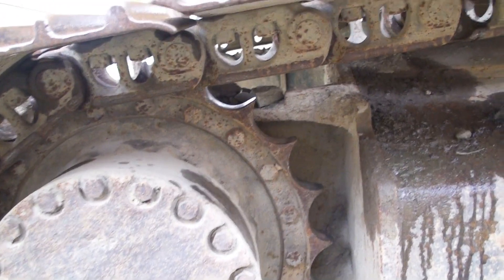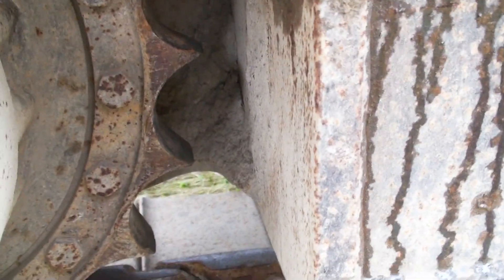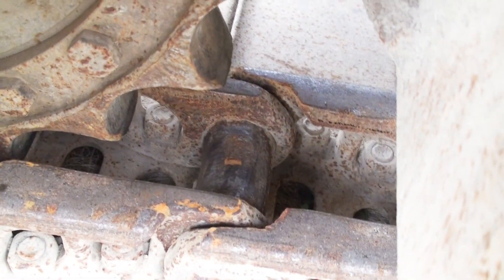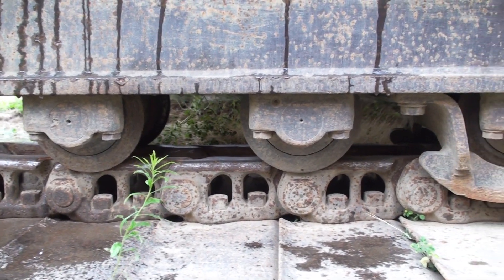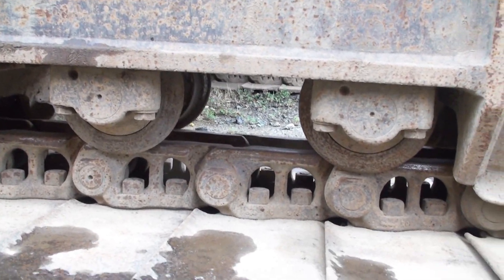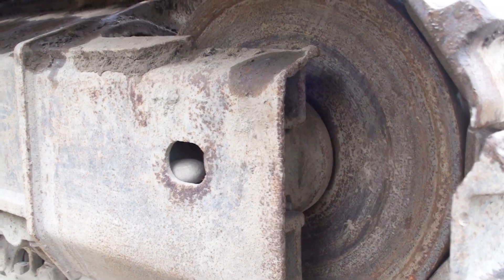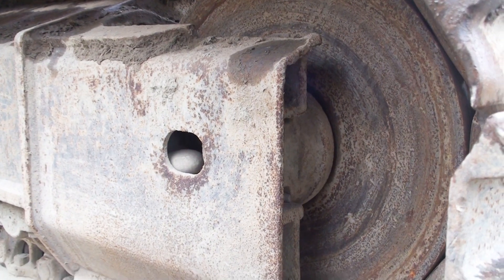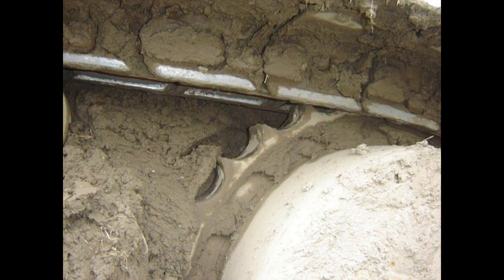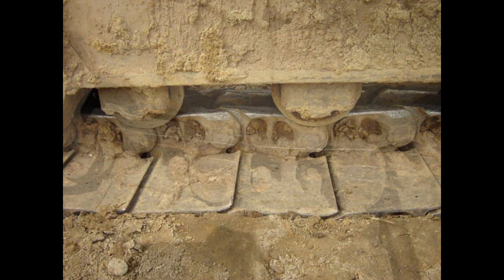Here is a quick inspection process that will give you a feel for the amount of wear on the bottom of a machine. I like to start at the sprockets, noting the wear on the tips of the teeth. I'll scan down to see if I can see the track bushings. Then I'll crouch low and look toward the front of the machine, looking for leaking bottom rollers and bottom roller flanges that are riding on the track pin bosses. I'll stand and look at the front idlers, checking where the support blocks are in relation to the track frame. Finally, I'll stand over the front idler, checking to see if the track links have spread on the track pins. Knowing the difference between new and worn out components will allow you to judge the overall wear on excavator tracked undercarriages.